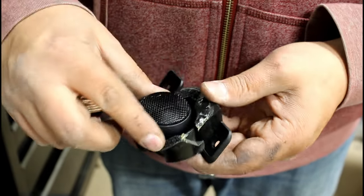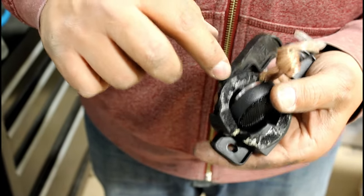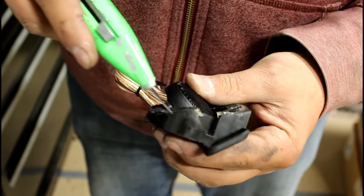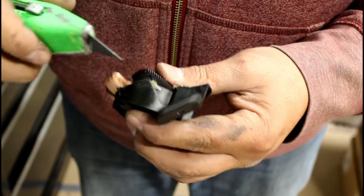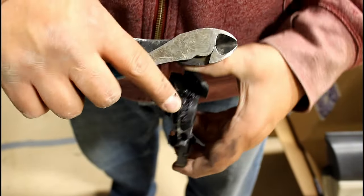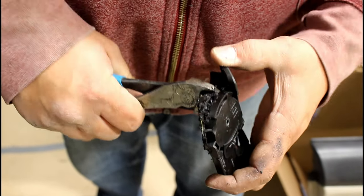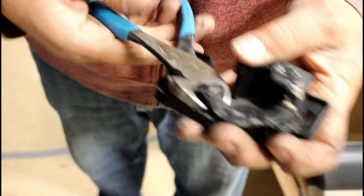Take some pliers, pull this out, and clean out the gap because this is where the new wire is going to sit. The tweeter is still too big, so I'm going to make a series of drill holes around here up until this wall. Do drill holes all the way around because if you try to just cut it with a pair of dikes it's gonna break the housing — you don't want that. Drill holes this way, then this way, and one this way. Then take your dikes and you can cut it without worrying about anything bad happening.